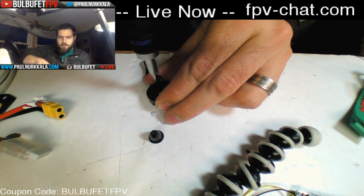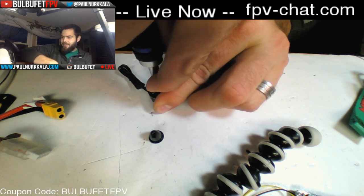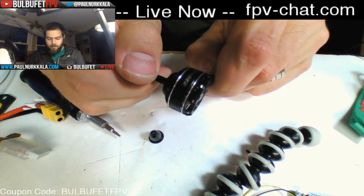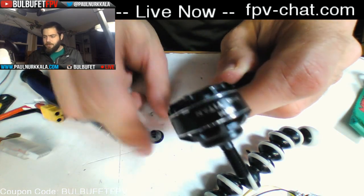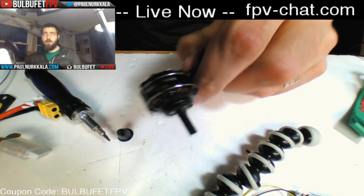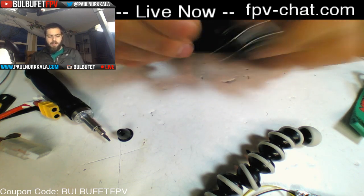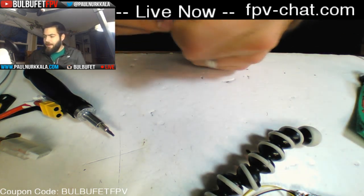Yeah, the stream will be posted as soon as we're done, so you can come back and follow along again, like a cooking show. Someone is wondering how the motors and ESC compare to the ones they were recommended. What were you recommended? I mean, these are strong, they're tough, they're actually light. They are lighter than Emax Red Bottoms, for example. And they produce a kilogram of thrust per corner with the right props, with 5-inch props. So you're creating a roughly 320 gram quad that is capable of producing 4,000 grams of thrust. You divide that out and you start getting some pretty serious power. So this will be just fine, especially for a first build. So grab it.